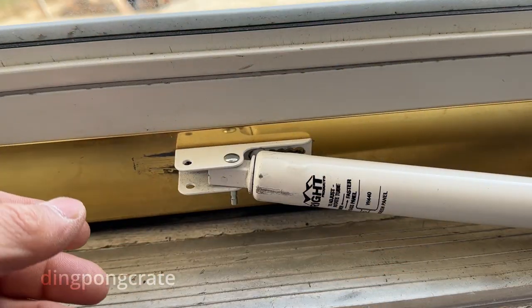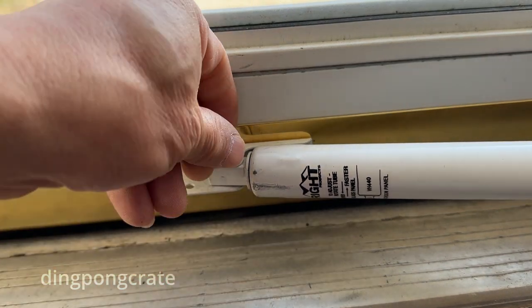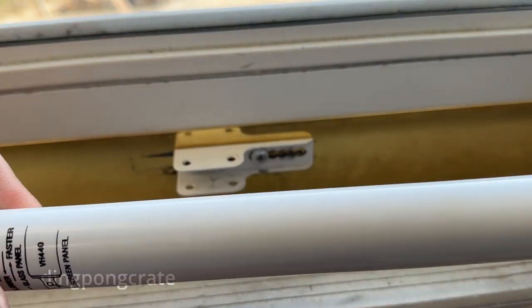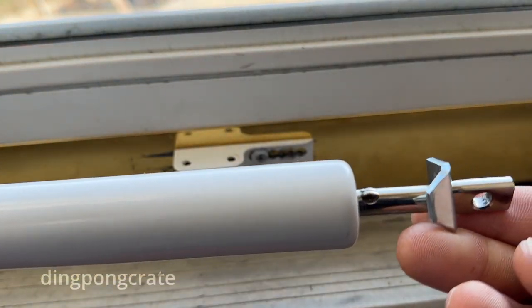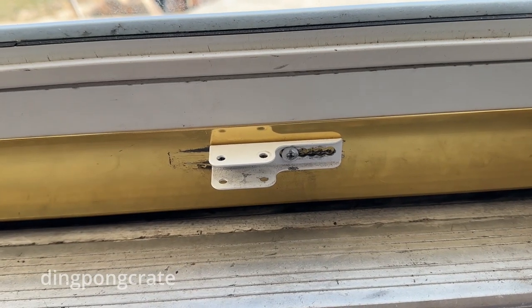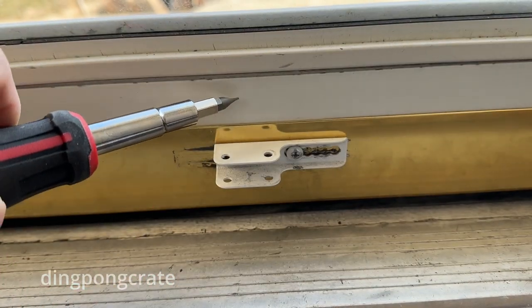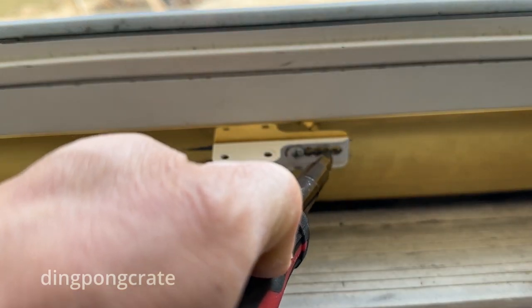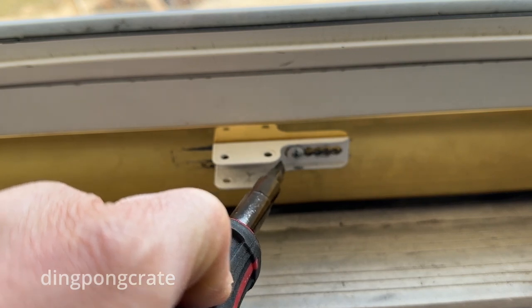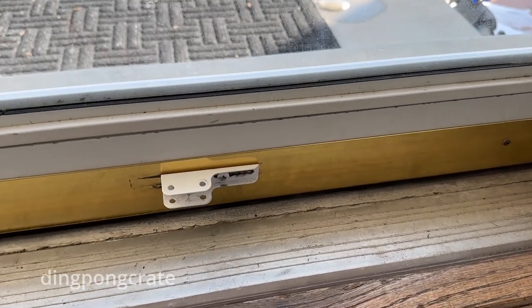The second thing you want to do is take the larger pin out by just lifting with your finger, pulling the pin up and out. And now's a good time to check the gas closer — we do need to adjust it, because it's opened and closed this storm door so much that this thing has shifted, and because of that the door does not close all the way. So it's just a simple fix.